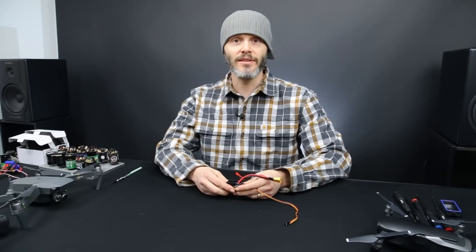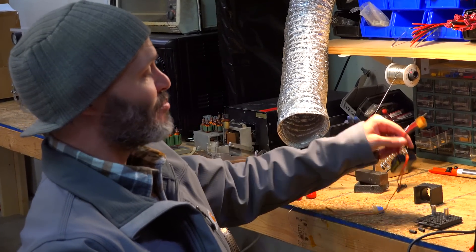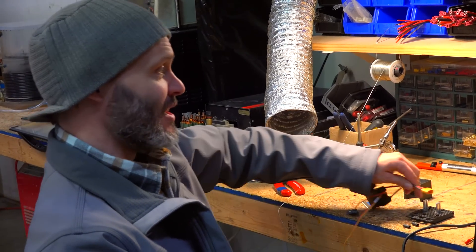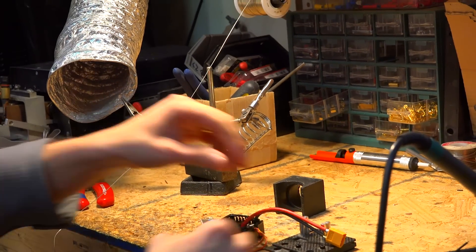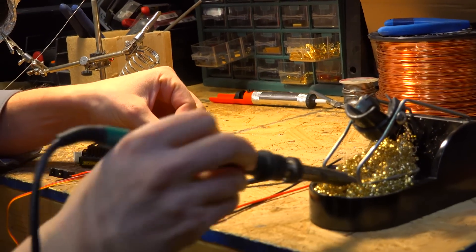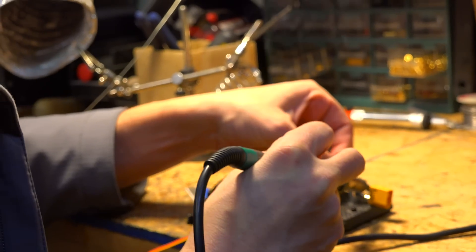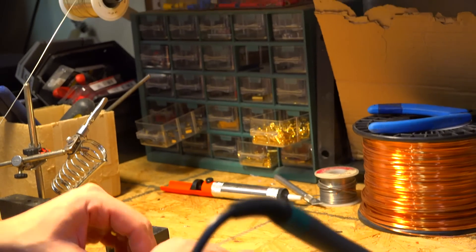That's really about all we can say about the technical aspects without actually going out and crawling it, so I think it's time to install it into a rig and go test it out. We're back at the shop here, going to do some soldering work because I put on a set of XT60 leads and realized that I forgot to put some power leads on for a servo. So we're going to fix that. First, we need to desolder the plug that's already on there, and then we'll add our heat shrink and re-solder. Already got our iron preheated here — the LF 3500 from Zyatronic. Nice beefy one, I think it's maybe 250 watt, 350 watt. It's big.